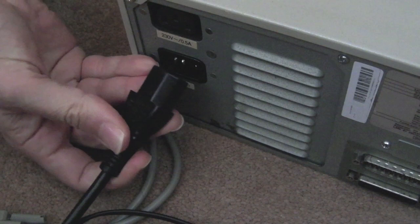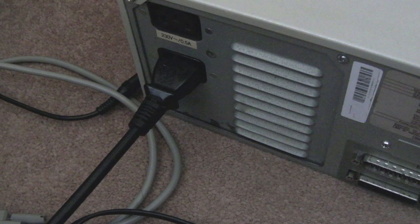So, I'll point you at the TV, we'll switch it on and just see how it's behaving. So, I switch it on. So, a green screen is a memory fault. It's repeatedly trying to boot there, isn't it? That's what's happening, we're getting a boot loop because of the green screen.